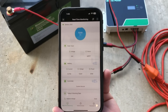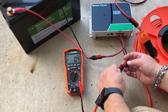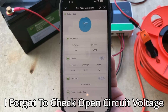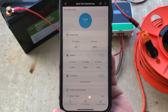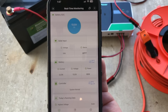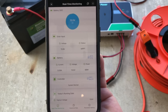Now let's try a longer cable — exponentially longer, but a little bit thicker gauge. Starting to ramp up: 4.85 amps. We're getting almost half the power we were getting going directly from the solar panels. About half of our power is being lost as heat in this cable.